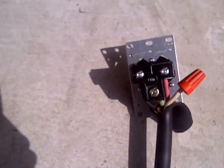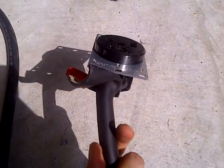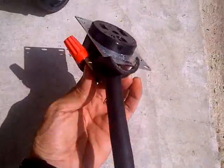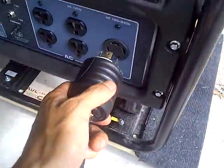So it turns out they don't make the adapters readily available for a welding situation. This is what I had to basically do — buy the receptacle, buy that plug, buy the 4-wire. This is 4-wire: 2 hots, a common, and a ground. 12-gauge stranded wire. I think 12-gauge worked. You just have to make it in order to make it work, because I was pulling my hair out trying to find something off the shelf.